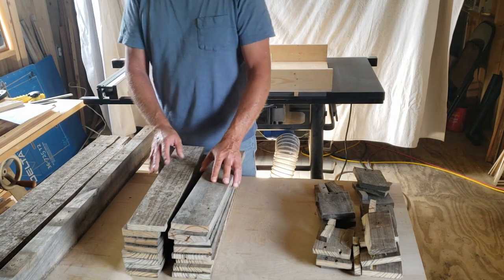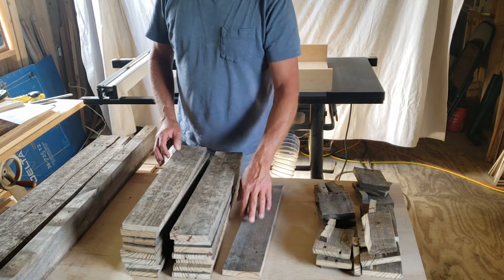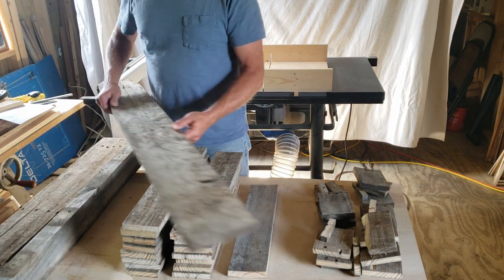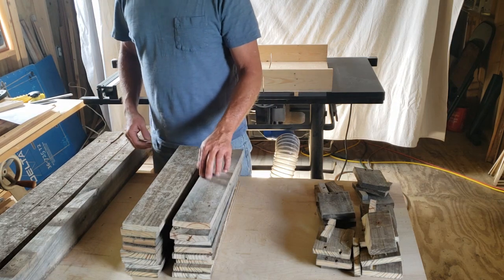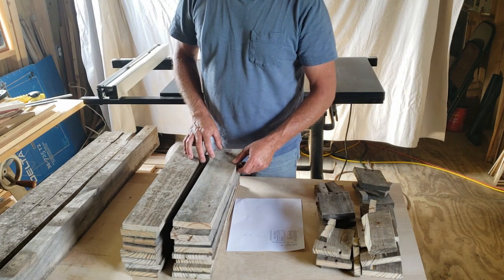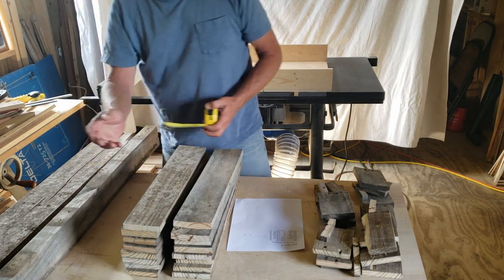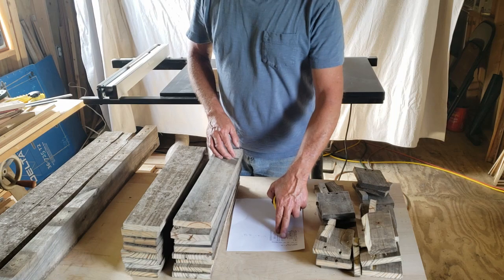This is all usable — some of it does have a little cup to it, some of it's pretty good. In dealing with this, I'll be cutting it, ripping it down the middle somewhere for my different pieces, and that'll take some of the effect of that cup out. But I do still have my one-by-fives. I'll be cutting those down to treat them more like one-by-fours. So I'm going to take my cut list and start at the top — leg A: 1¾ by 14. My shortest ones are down here at the bottom and they're 15½, going up to 19 — they're 17¼. So I've got plenty of length.